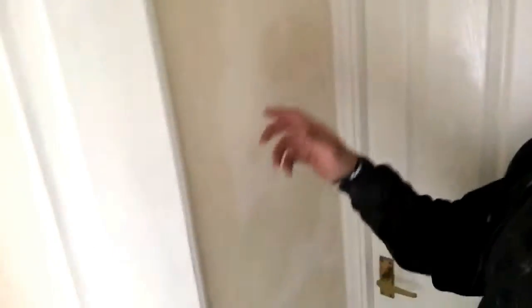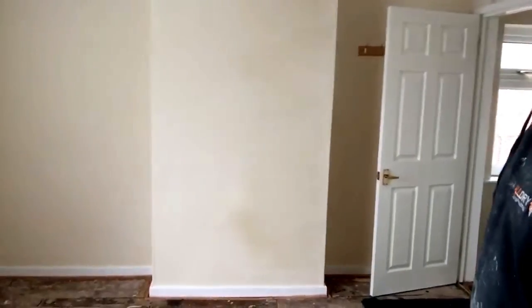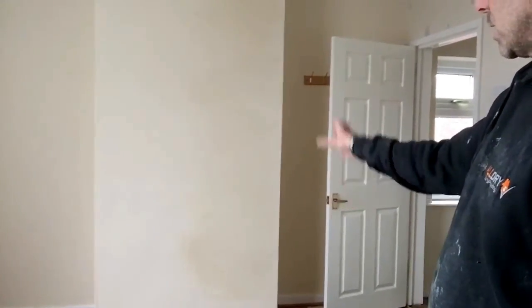I'm going to skip upstairs. On Monday all this is going to be covered in carpet protector. They've already taken the carpets up upstairs. I've already marked on this one — we've got this chimney breast from down here with patches on it — sulfate salts — but we're going to sort that out for this lovely couple. And if I come back here, you can just see that staining — sulfate again — at the bottom of the chimney breast. It's affected both holes at either side, so we're going to sort that out as well.